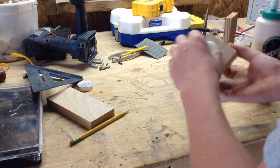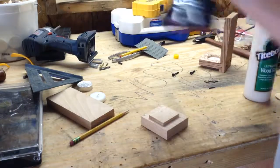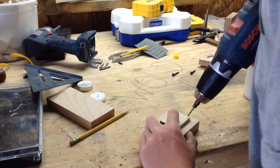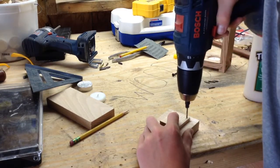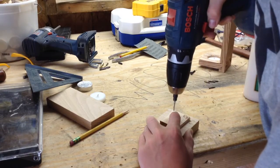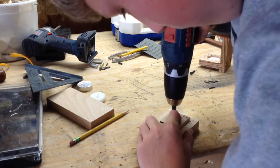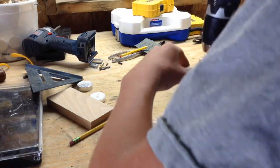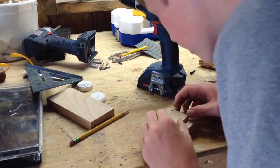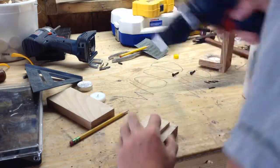This piece is three-quarter inches — it's kind of thick for these candles but it'll be fine. Now that we have that with our gap, I'm going to take my drill with a pre-drill and countersink bit. I'll drill right on the edges of the corners, all the way through until it gets to the countersink portion. Depending on how thick your material is, you'll have to see how far to drill down, but mine is three-quarter inch and this works.